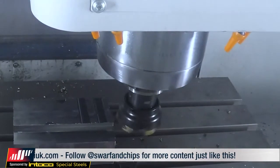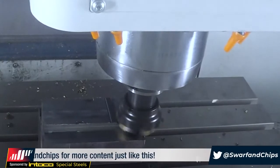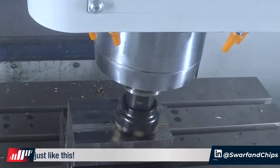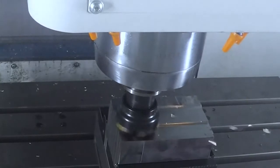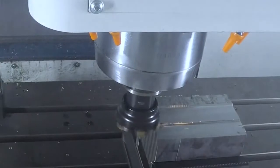We're now going to use a 45-degree cutter - this is the Dodeca system, the mini version. It only takes a low depth of cut but it's an economical 12-sided insert versus four. The piece of carbide is similar shape, size, and cost, but we've got 12 edges running. This has to do two passes, but the feed rate is 50 percent higher due to the 45-degree angle, and it's more economical.